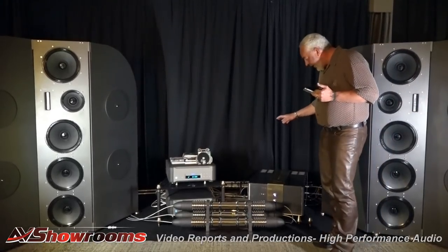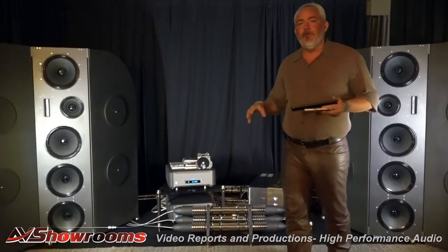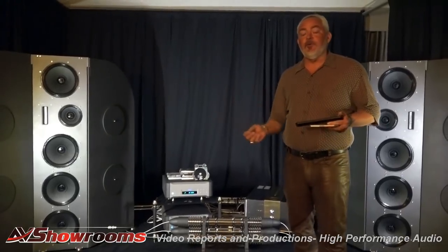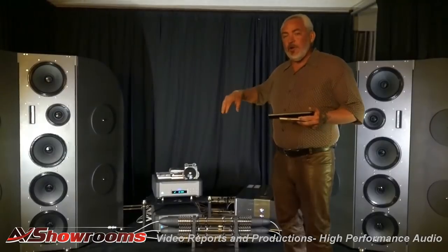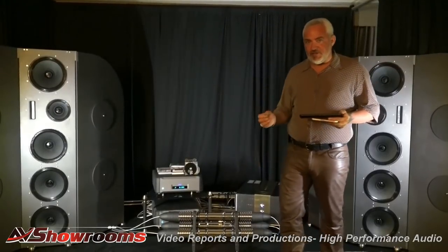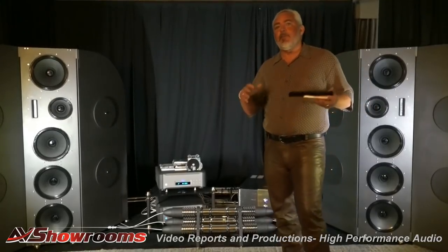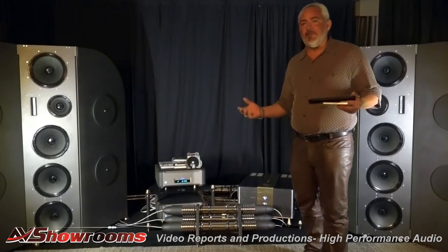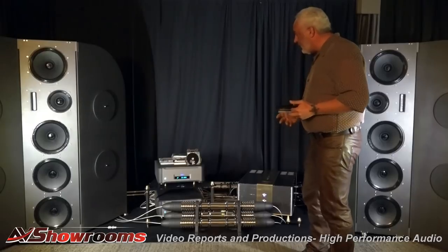Wow. So then we've got the amplifier. High Fidelity Cables is going to be the distributor for Luminance Audio amplifiers. We work together on that. Steve Kaiser, who is the K from B&K, is actually responsible for the circuits, and he's come up with some really fresh new stuff. This new one has a technology called current injection, and based on what Steve tells me, theoretically it's impossible for the actual FET devices to create distortion the way he's done it. They inject current into the actual signal path. So it's really unique too.